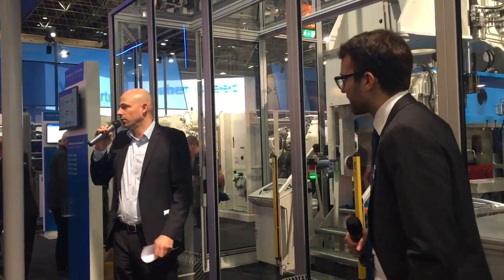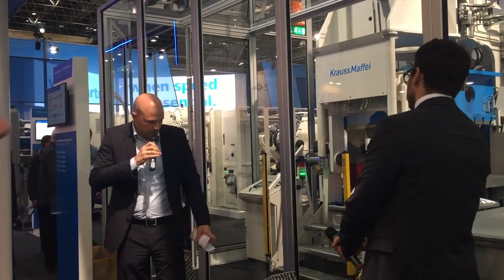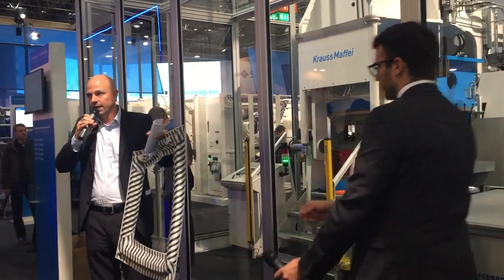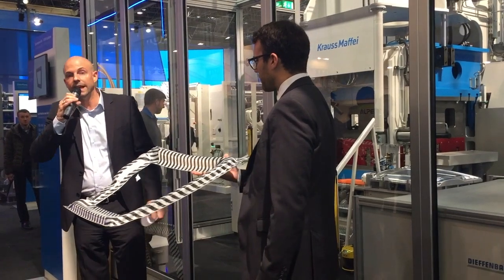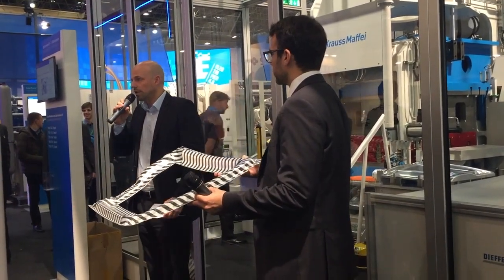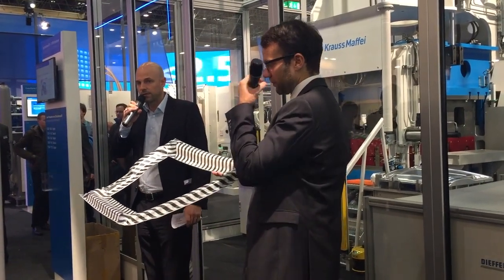That is a sports car that has been fully designed and is also being manufactured in the city of Roding in Bavaria, Germany. This structural part consists of a hybrid fiber in a thermoplastic matrix. It has the size of 772 by 585 millimeters and, while being extremely stiff, durable, and light, it is only 1.2 millimeters thick. So that's quite impressive.